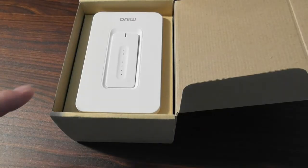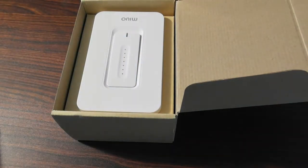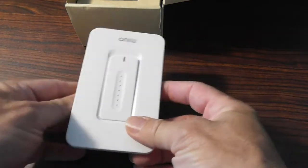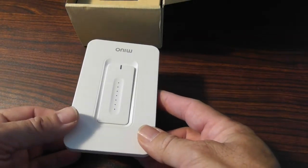One of the things you need to know: you need to use the faceplate that comes with the switch. You cannot use this with a three-way switching circuit, only with a one-way. This will only fit into an outlet box where one unit is installed — you can't have two switches or a duplex outlet box.